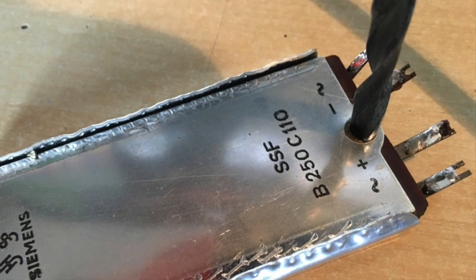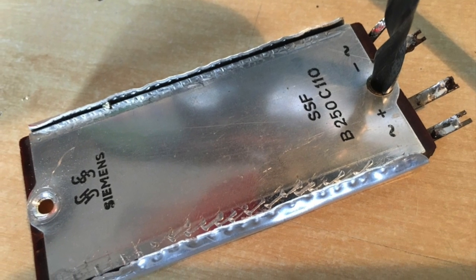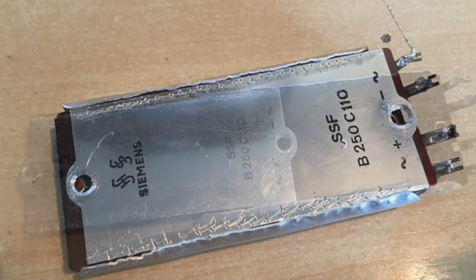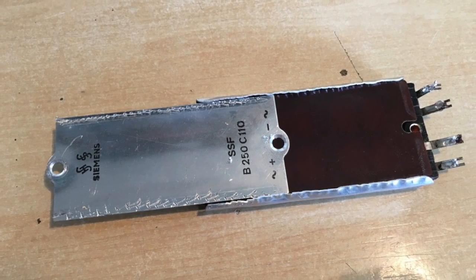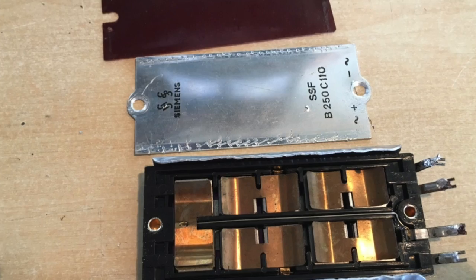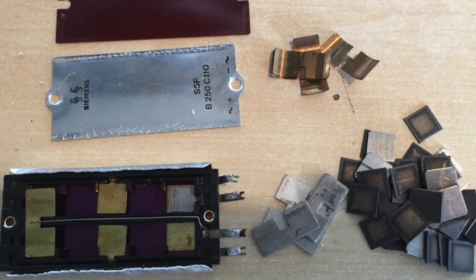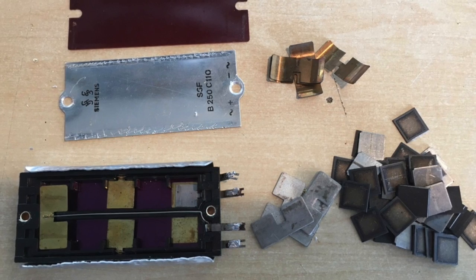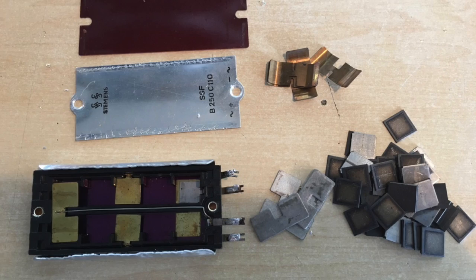This particular one has two brass rivets that hold the panels together — this is the first case where I've actually found rivets; usually you don't have them at all. Using a drill bit you can very carefully drill the rivets out and you're good to go. The top plate then just slides out, and what you're left with is the interior with spring-loaded clips that hold the selenium plates in position. The clips come off, and below that you'll find the selenium plates stacked together above the contacts.